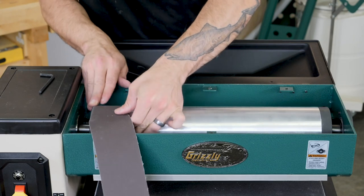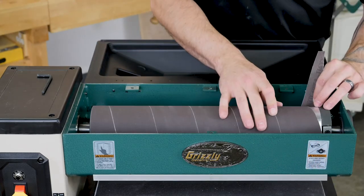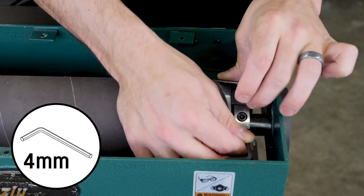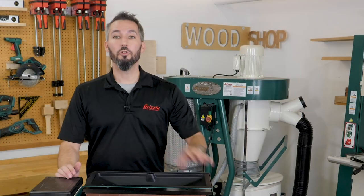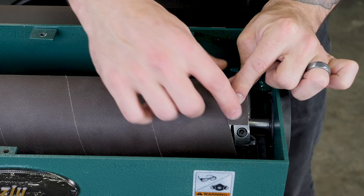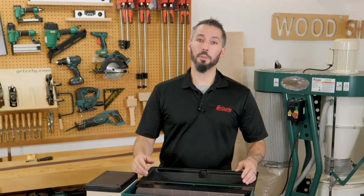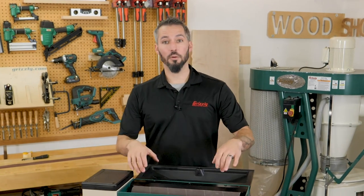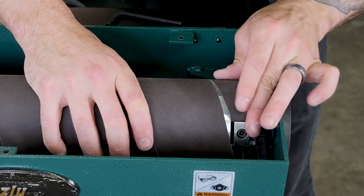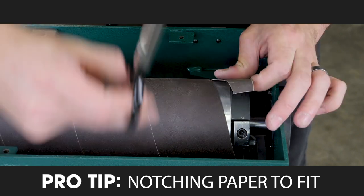Wrap the strip around the drum, ensuring that there are no bubbles or overlapping edges. When the sandpaper reaches the right side of the drum, move the sandpaper out of the way, and with a 4 millimeter hex wrench, insert the wrench into the access hole on the drum. Rotate the drum toward you until the hex wrench rests on the top of the frame. When you reach the end of the drum, ensure that the clamp is open and insert the paper end. The drum is spring-loaded to allow tension to be applied to the sandpaper strip, so twist the drum with one hand and insert the tag end of the paper. The wrap may become skewed at the end near the right clamp, and to properly align the paper edge, you may need to notch it for a nice clean edge alignment.